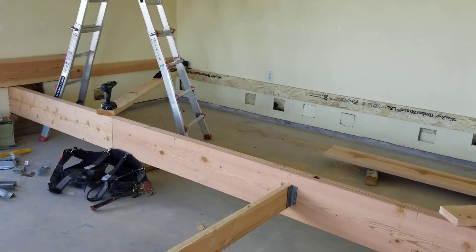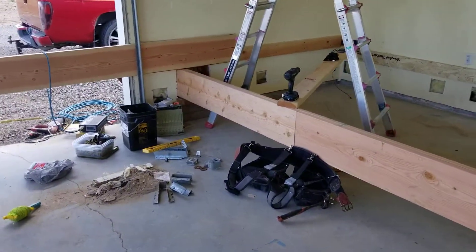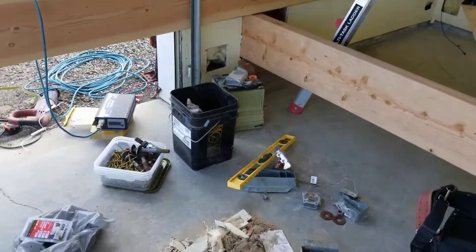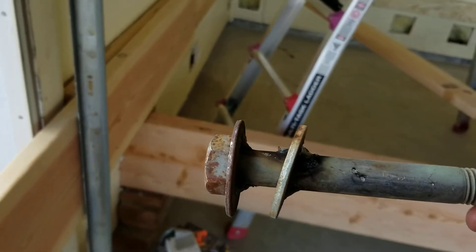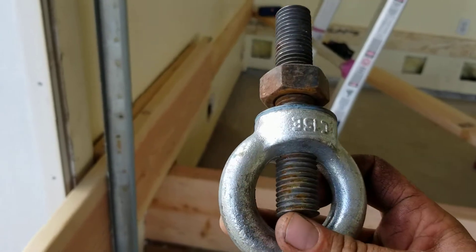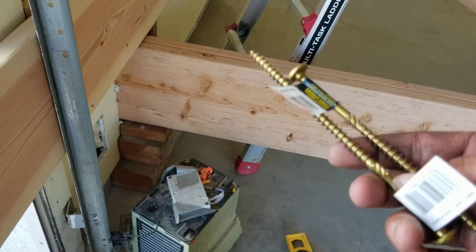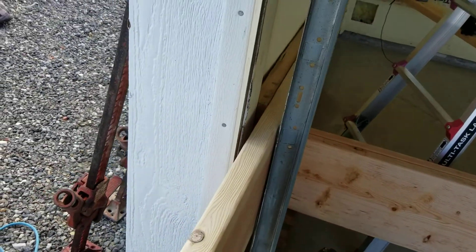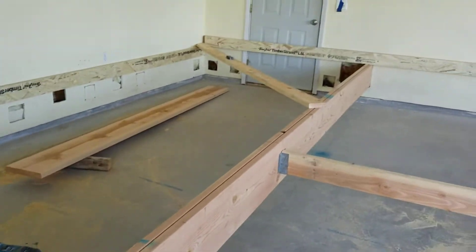Everything should pan out really well. We're going to be loading it up on the trailer and strapping it down using a couple of different methods. On some of the 2x12s we'll hook straps at the end and tie back down to the trailer, and we'll also use some of the holes that already exist in the sill plate to tie it to the trailer. We've got some bigger construction screws that will really help bring home the areas where we've got multiple boards laying on top of each other — and that is how we're going to move this garage.